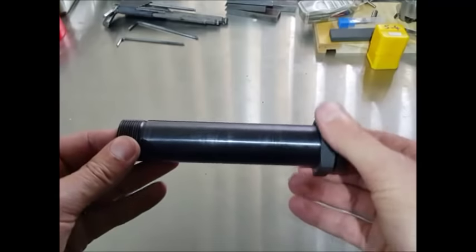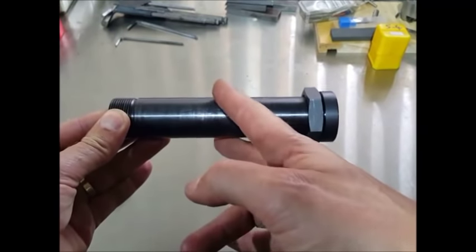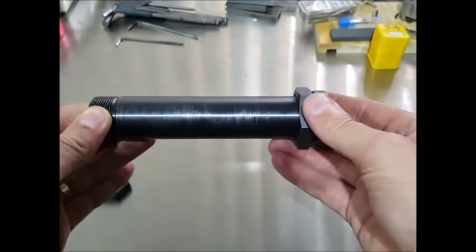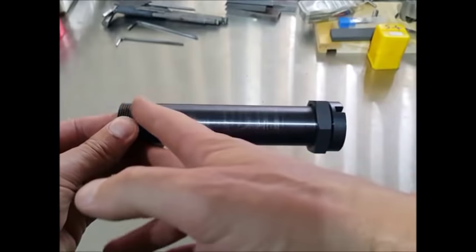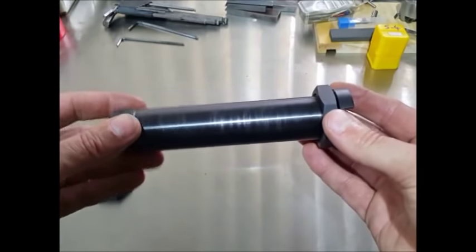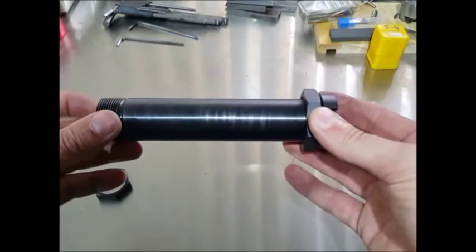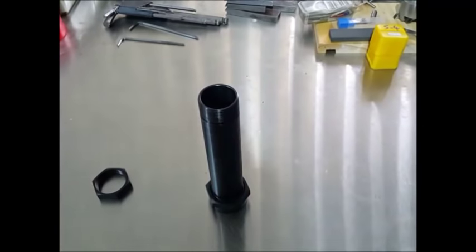And then that way I'm going to machine all the collars to fit the OD of this tube, and then mount them all on here. I'll mount this in the lathe, and then I'll machine the whole lot in one go, which is going to get all the circumferences of those correct all in one hit. So that's what we're going to do, and that's the plan.